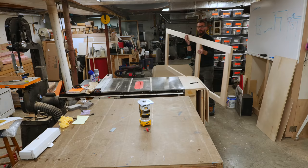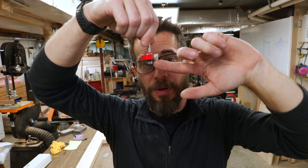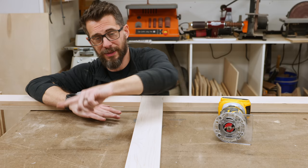The frame is now dry enough to move on. I'm choosing to use the back side as the side that has the short ends — the cross pieces are on the back side — because I like the look of pieces going all the way top to bottom on the front. I've got it laid on its front because I need to cut a rabbet into the back side into both of these openings. A rabbeting bit goes in a router and has a bearing on the bottom. That bearing pushes into the material and the cutting head cuts away the material above it, making a little shelf on the back side. I'll run around, lower the bit, and run around again to end up with about three-quarters to an inch of rabbet on both sections, so I can set in the panels and hold them in place with trim on the back.